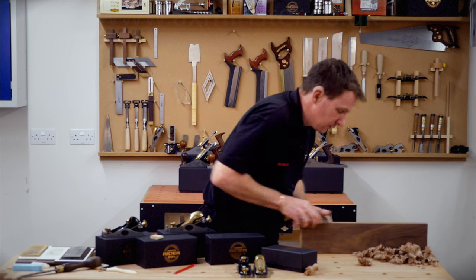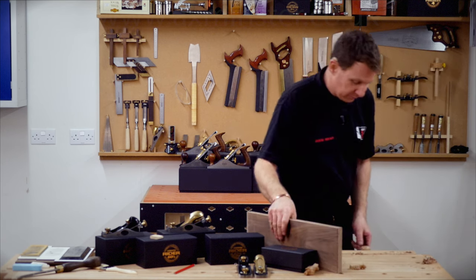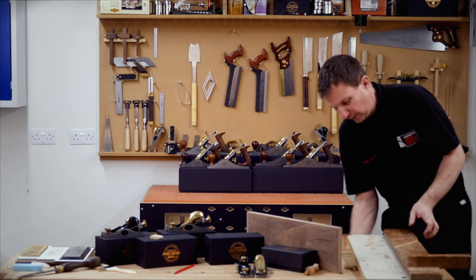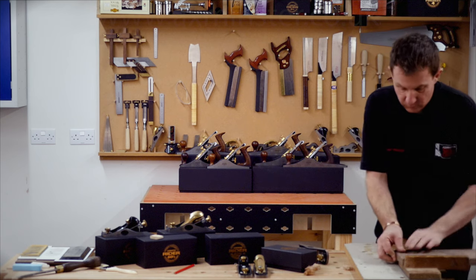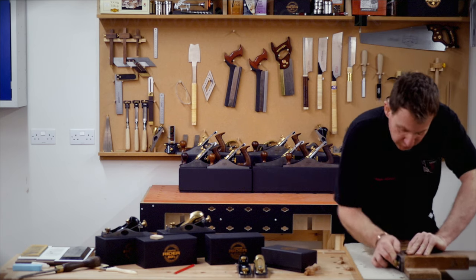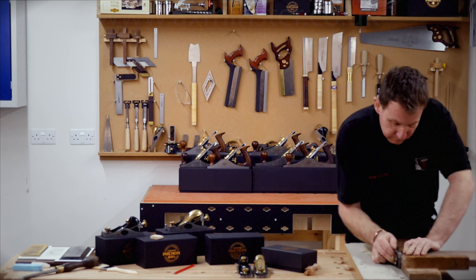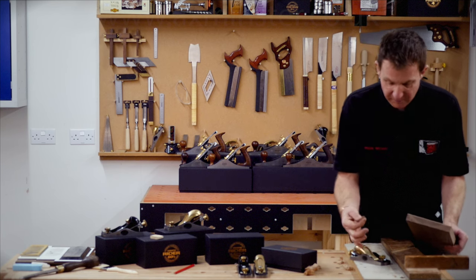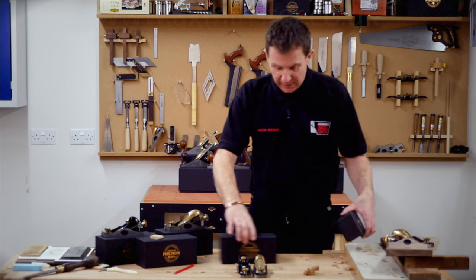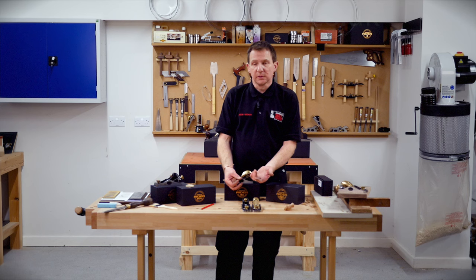Got a nice light shaving. These are beautiful because you can almost put them in your pocket. The other thing you can obviously do with these — which is really where the name comes from, 'block plane' — they were traditionally used for cutting the end grain on butcher's block chopping blocks. So in the vice I put my shooting board. We want to plane the end square. It's just a way of cutting the end grain fibres, just as much as the long grain. This is where that low angle really becomes important. Getting no tear out, cutting nice and cleanly across the end grain — a different type of fibre. Your little block plane: very useful piece of kit. Hopefully you'll understand the differences between the standard, the deluxe, and the different angles. The lower the angle, the easier it is to cut with. So that's the range of block planes.